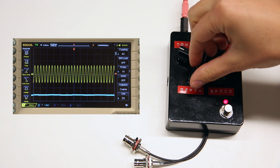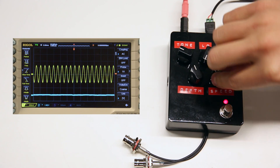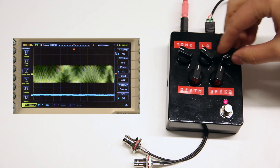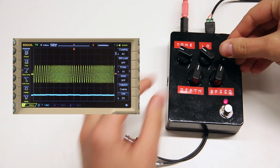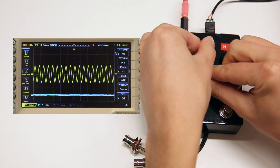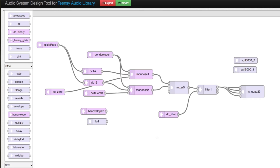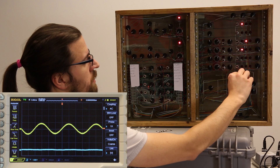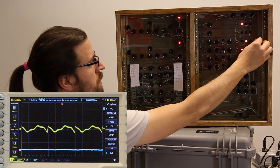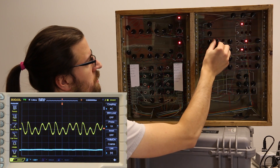This pedal is running a sketch that demonstrates a single oscillator and its modulation ability — the tone can be bent and an LFO applied. The big panel has two of these oscillators in use, as well as some mod sources, a bunch of DC control blocks, and a simple filter. With this system, I configure my waves as a mixture of sources, apply them to the oscillators, and set up the oscillator frequencies.